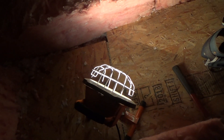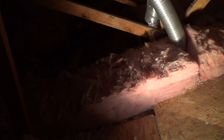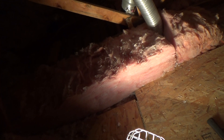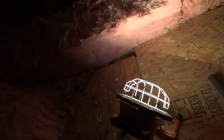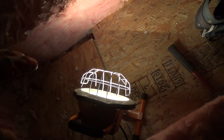When you replace the bulb, you don't want to get your fingers on it. They have a little styrofoam thing around the bulb and you need to be real careful, because your fingerprints will put oil on the bulb. When the bulb heats up, it's liable to burn out because of that. I had one burn out and the construction light was only about three months old — that could have had something to do with it.